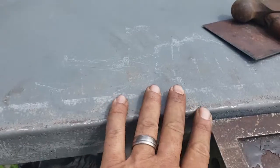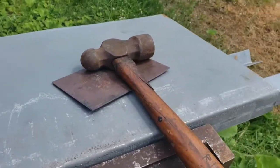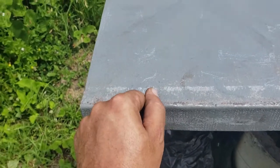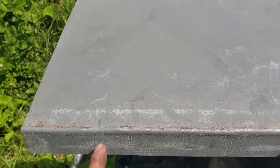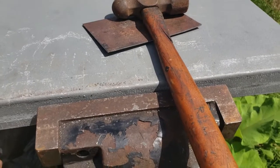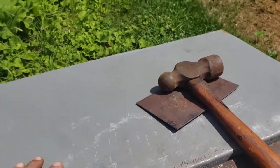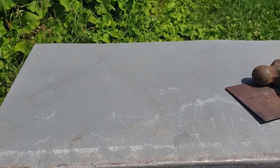Now I'm going to hit this with a wire wheel, coat it front and back with some white paint, let it dry. We'll do the other one similarly, cut it out and bend this over. And I'll cut these tabs to the right dimension when I go up to the bus and fit it, based on where this needs to be tabbed out. And then this will get riveted into the hat channel, and we'll drill holes from the inside out for these other edges with some Sikaflex around the whole thing. So that'll cover that top gap.